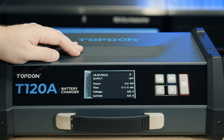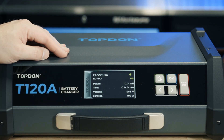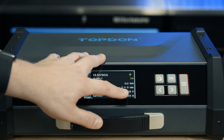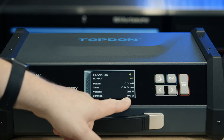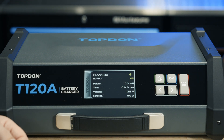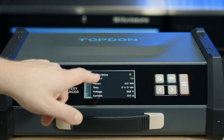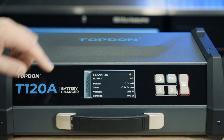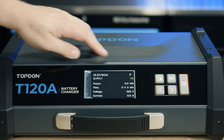If we hit the start/stop button it will shut off; hit it again and it turns back on. Supply mode shows us everything live — 13.5 volts is our output, which is what we set it to. It shows how much current is being pushed to the battery, the on-time, and the power, which is a log of how many watt-hours have been pushed into the battery for the duration of the voltage supply mode operation.